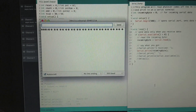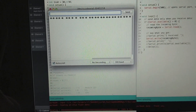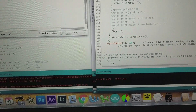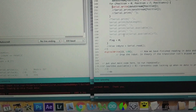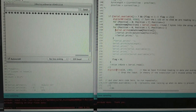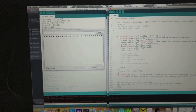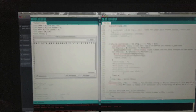Switching to serial.write, the Metro Mini output is an exact duplicate of the Uno stream but with no extra delays — so there's a lot more bandwidth and we're not losing data. That's what was getting me — I didn't realize all the extra bandwidth required for serial.print. When I had multiple serial.print commands for spaces, byte length, serial.available, and so on, that was all extra overhead going way off the charts. Using a logic analyzer to see what's going on behind the scenes made this clear.